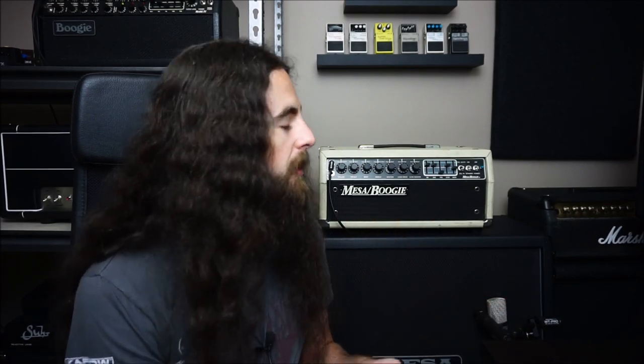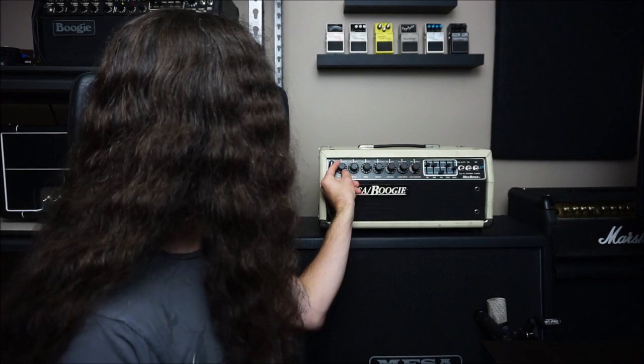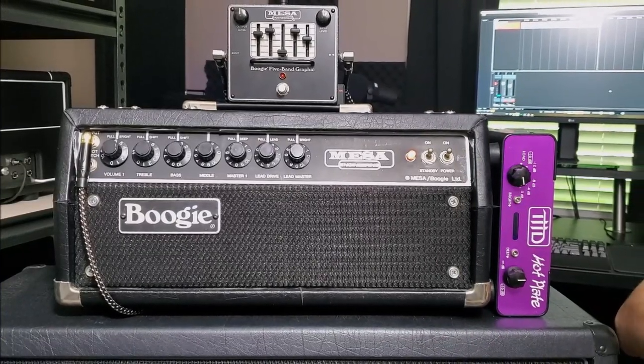Kind of hard thing to think about. But this one, I think, adds a capacitor somewhere in parallel that clips some of the high frequency content. It just sounds more saturated that way. So this is the same function across all the amps. But that's about where it ends, because you see where the 3 and 2 share the volume control on all the channels, it also shares the pull bright control on the lead channel, which acts like any other bright control would on a 6505 or a dual rectifier or a hot rodded Marshall. But this control is absent from the Mark IV, so you don't have that option.